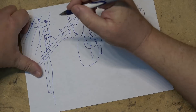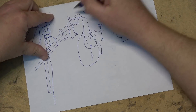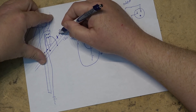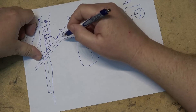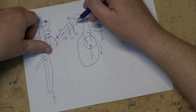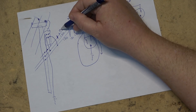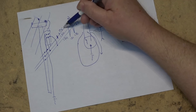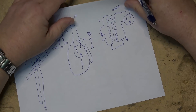If you break the neutral — say you cut that neutral line — the entire return from the circuit would be present at the break point, with lots of voltage there. This is what happens when the neutral breaks at the pole or at the transformer bond. If one appliance is drawing full power on one side and you break the neutral, the neutral would rise to 120 volts, and appliances on the other side would see 240 volts across them. That's a topic for a different video.